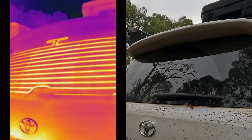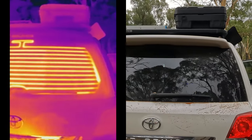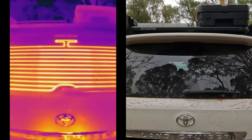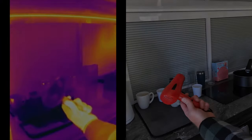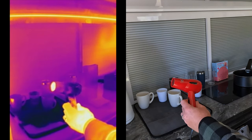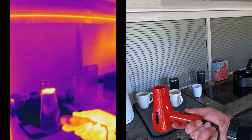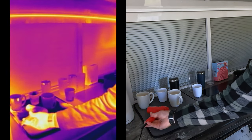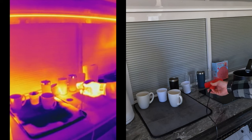Given that glass is an opaque surface in infrared, we can still detect infrared on its surface — like in this example with the rear window demister on the back of the Land Cruiser. Regarding gases, thermal imaging cameras won't be able to pick up infrared radiation through gases unless there are a lot of impurities present. We can see this with the hairdryer — the unit itself heats up very quickly, however we are not seeing a trail of hot air from the spout in the infrared band. But if we use the hairdryer to heat up solid objects, we can clearly see the radiation emitted from them.